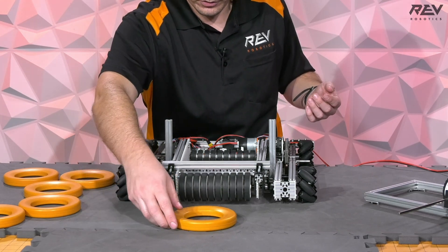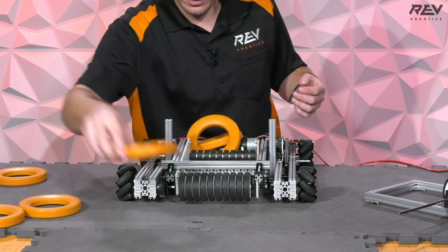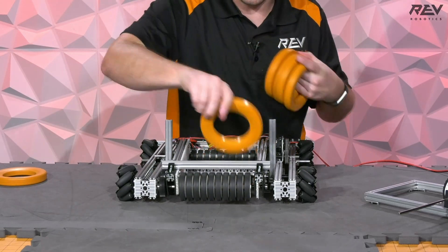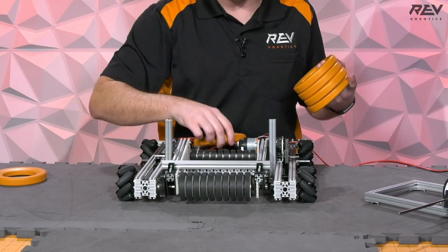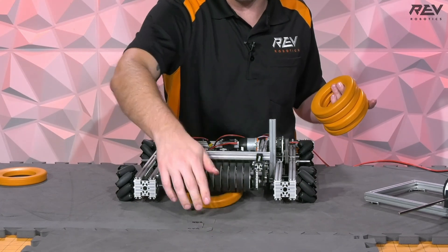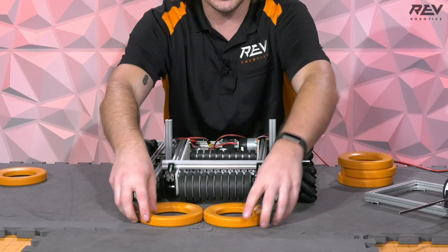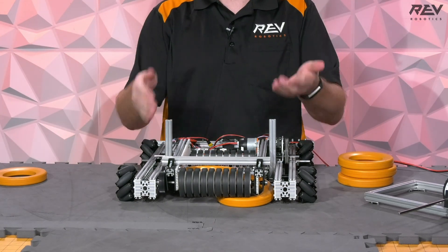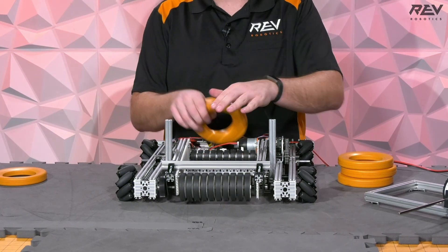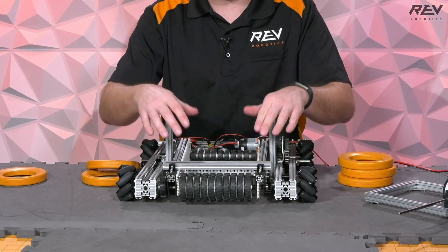Let's give this a start and kick it forward. Once this is running, things very easily run in and pop right out and up, which is pretty nifty — especially if you want to hand off to some sort of area. One thing that can happen, though, is that if this doesn't have enough downforce it will skip sometimes before riding up. We've also noticed that when you put two pieces in, it will jam until you give it enough juice, so there needs to be some refinement.